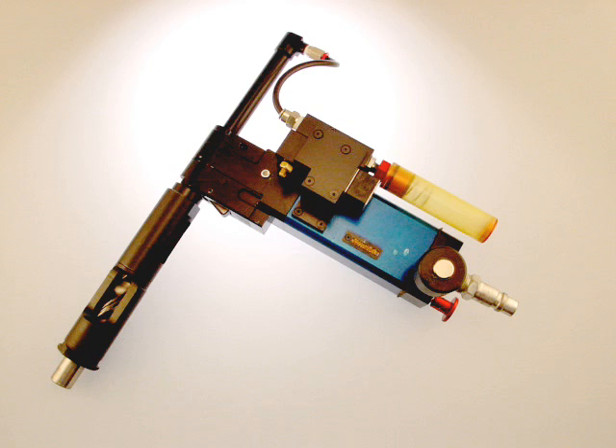Powered by a 1.5 nominal horsepower air motor, the ZT3000 is designed to drill 3/4-inch holes in aircraft aluminum and 1/2-inch holes in stainless and titanium alloys. Key design features of the ZT3000 include a modular design concept with excellent ergonomics.